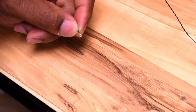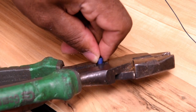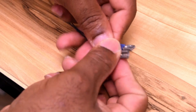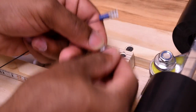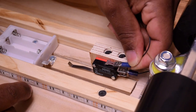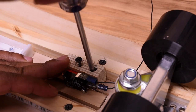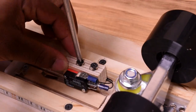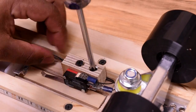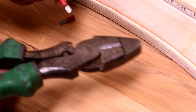To wire the switch up, all you need is a short piece of wire. In my case I'm using 22 gauge wire with some spade connectors — we're going to make up two of those. Install one leg on the normally open on the relay and the other leg on the common. Now I'm removing this so I can cut off the corners to create a location to route the wires. Then make up two more cables doing the same thing for the power switch.